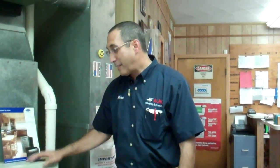I might add that the average furnace that's not maintained has over 10 pounds of dirt. So just imagine 2 5-pound bags of flour and I threw them into your furnace. They've done lots of studies where they've taken a furnace that has not been maintained and actually sucked all the dirt out of it, and it comes to 10 pounds. So you can see this is a machine, and when you throw that kind of dirt into a machine, it really destroys it and wears it down much quicker.